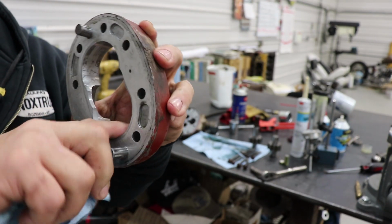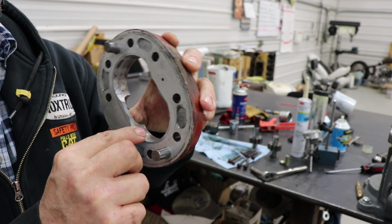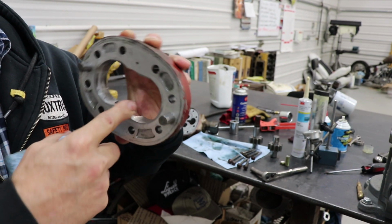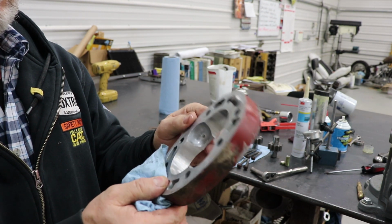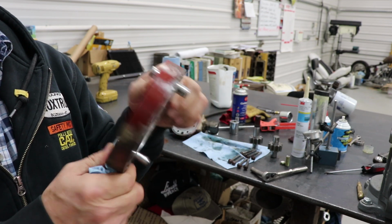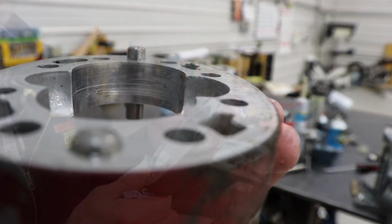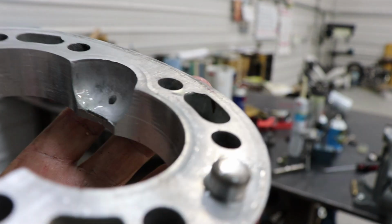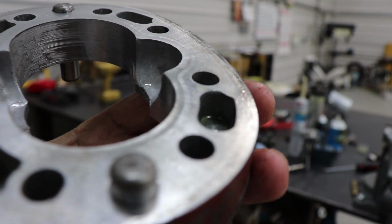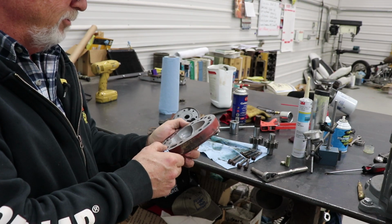So that's why this pump doesn't work too well. I mean, it's really got a ridge on it right here. The gear is really worn in here. And that's why I'm not seeing a lot of wear on the gear teeth themselves, is they're hardened steel, but this is aluminum. So this is the sacrificial piece here. There, you see that wear? And it's on both ends here. It's really tore it up. It's moved a lot of material there. Put a lot of crap through the system.